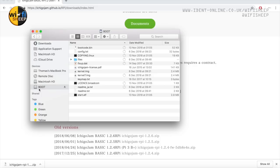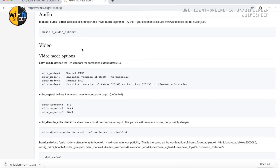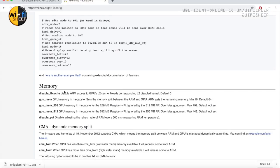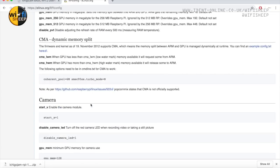So we need to change the broadcast standard in the config file on our Raspberry Pi distribution. With the SD card on a computer, we open the main root directory of boot and look for the file config.txt - this can be opened in any text editor and there's not an awful lot of data in there. We add a new line: SDTV_mode=2 - and 2 will set it up for PAL. If you want to check any other configurations you might need, you can go to elinux.org/RPi_config and this page will tell you all the different parameters you can put into your config file for booting your Raspberry Pi.